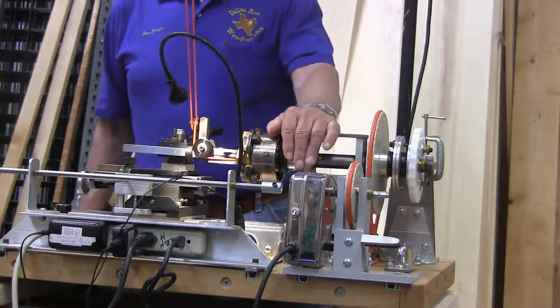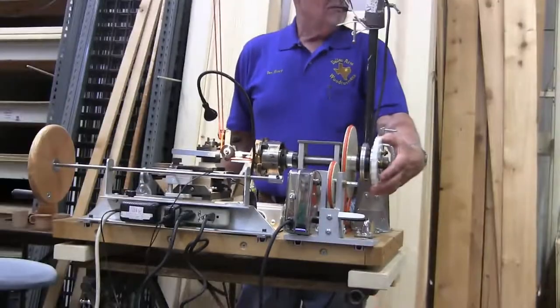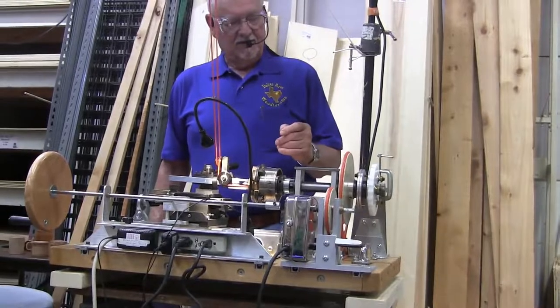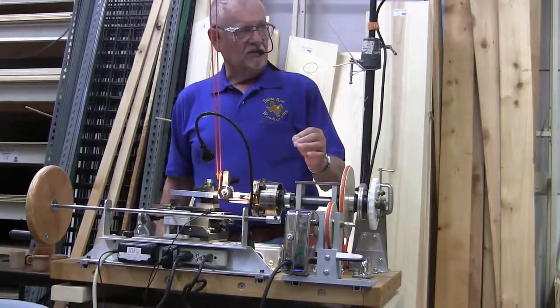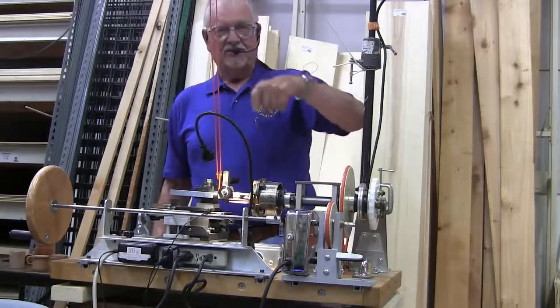Well, this is considered a rose engine lathe because the rosettes resemble a rose. An engine lathe does not have the rosette. It just moves in straight lines or indexes, or the reciprocator, where it's kind of like a ratchet affair.